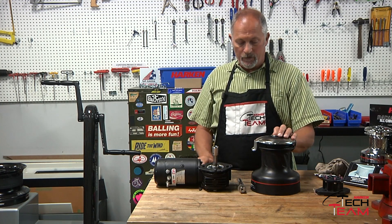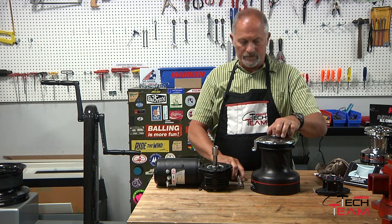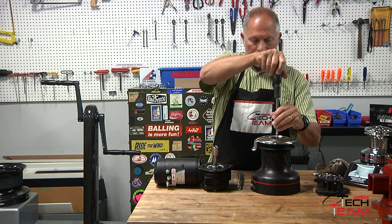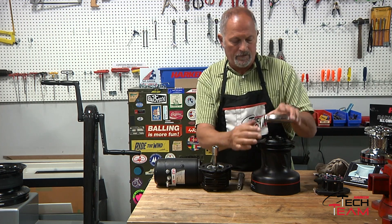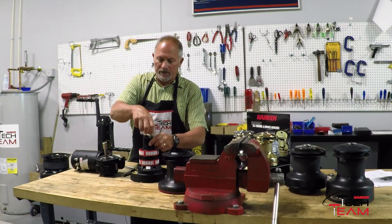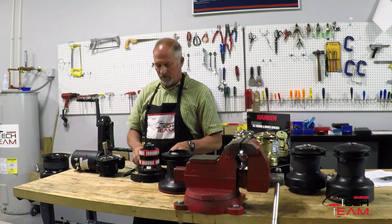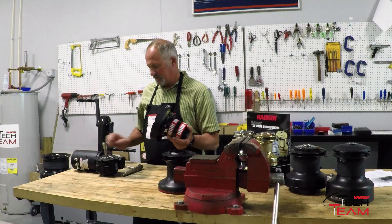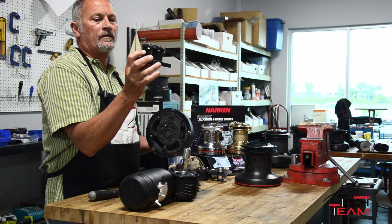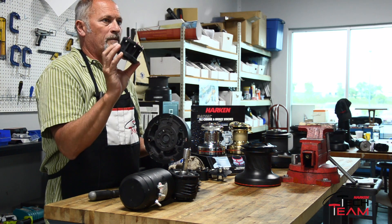The parts you need to convert your winch to electric: the center shaft has to be changed in the winch. All the bases are pre-drilled and tapped to accept the motor support. For installation, the first thing you'll do is take your winch off the deck, drill the proper size hole, and remount the winch. This is the support — it's an aluminum casting with six bolts pre-coated with red Loctite, making it a more or less permanent fix.